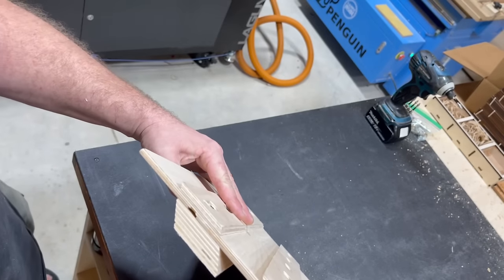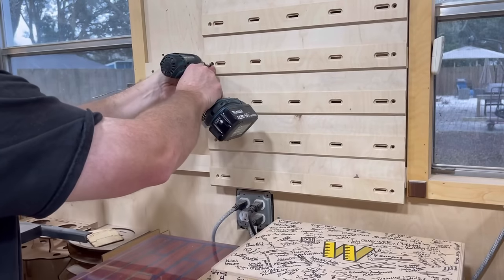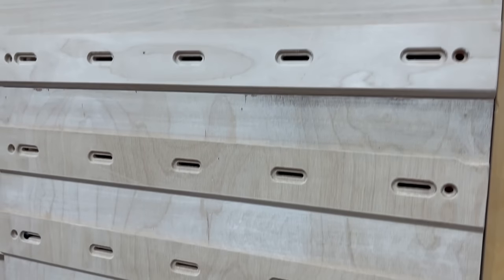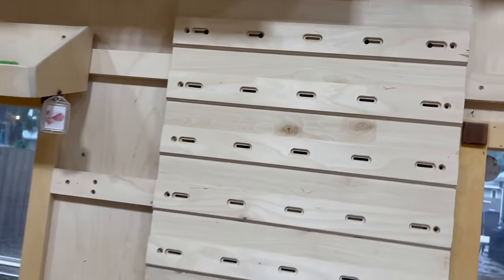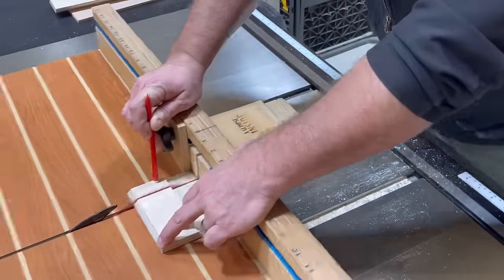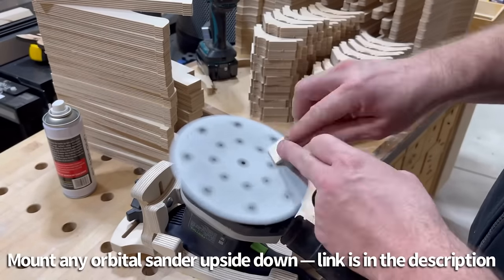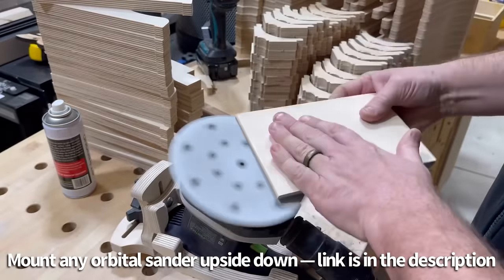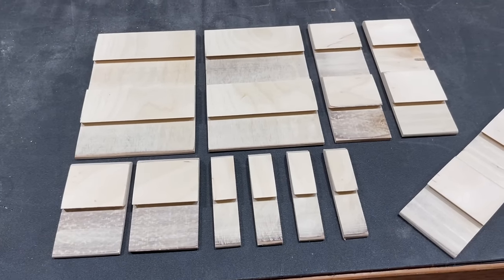Let's go ahead and put it up on the wall. I'm going to anchor it on the bottom with a couple of three-quarter inch screws as well. A couple of little details: the cleats are spaced four inches apart, each cleat is milled on the CNC to be two inches, the void in between each one is two inches, and the thickness of the cleats is only a quarter of an inch. But as you saw in the beginning, the guy was able to walk on it. I'm going to sand some of these pieces down and incorporate them in a couple of examples for you later.